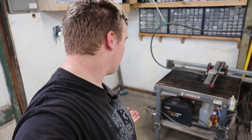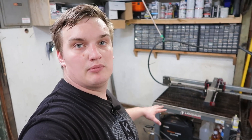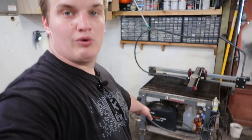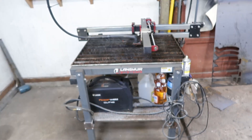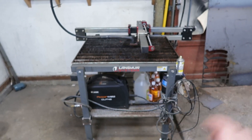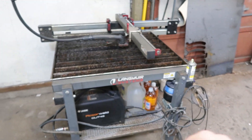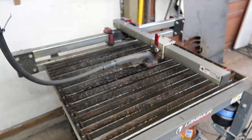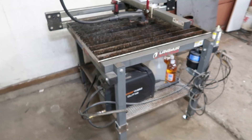So as your machine head is moving around, that base is not completely rigid. What that shelf did for me is isolate the lower legs and make this more of a rigid box, so the machine isn't wiggling as it's cutting and everything is staying more true to itself.